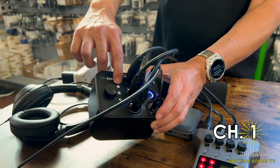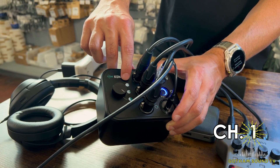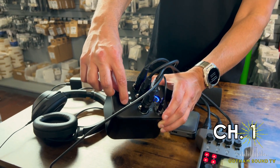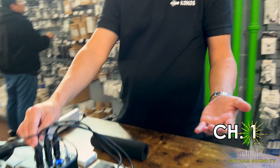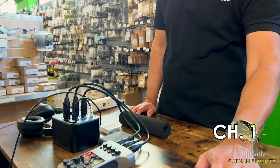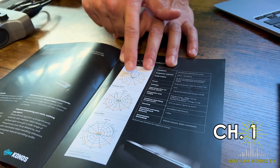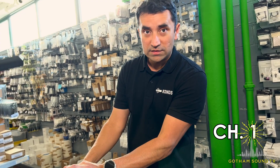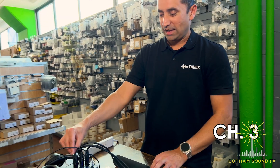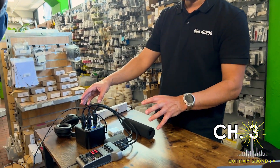The green part gives you your front channel and the white part gives you your rear channel. If you think of it as a pizza, based on how hungry you are, you can go for a sliver or just half the pizza. Then what's channel 3? Because we use math to capture audio now, we can take the front channel and extract everything in the back that may be bleeding into the front channel — so we use math to do that. You take what you want, you've got what you don't want, and you extract that, forming real-time noise cancellation. There is a little bit of processing going on in this box, and it introduces about two frames of delay, but that's manageable in most workflows.